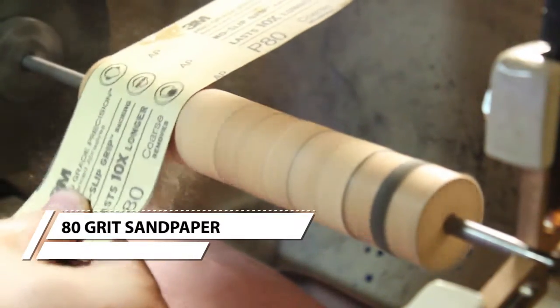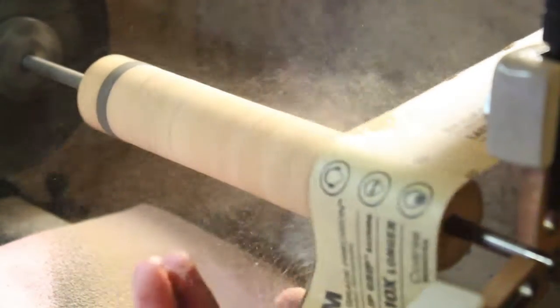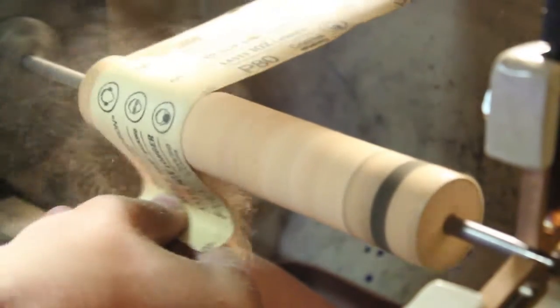Once the glue is dry, the shaft was removed from the clamping halves and mounted into the lathe. I used a steady rest to support the opposite end. Forming the grip into the classic wells shape was accomplished using sandpaper starting at 80 grit and moving all the way to a finishing grit of 400.